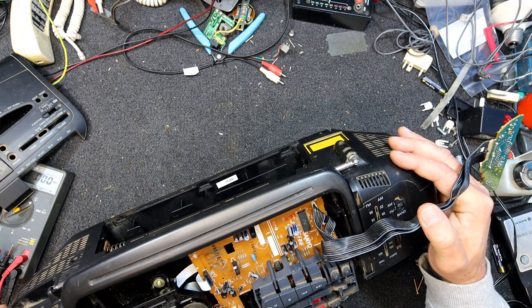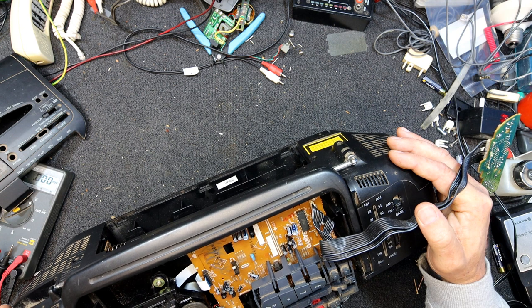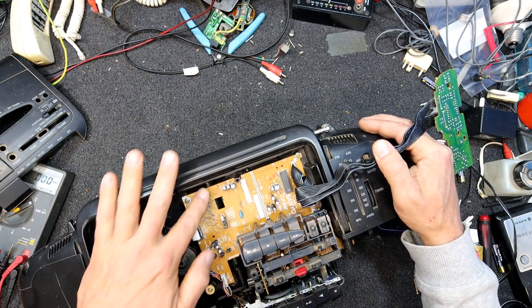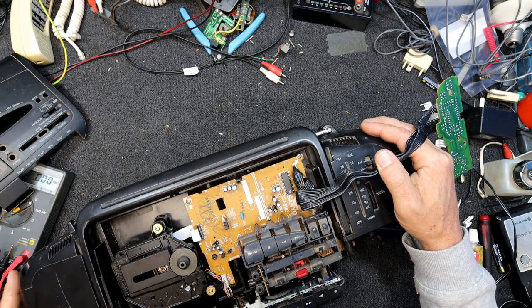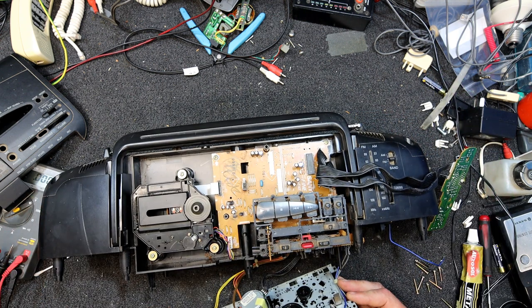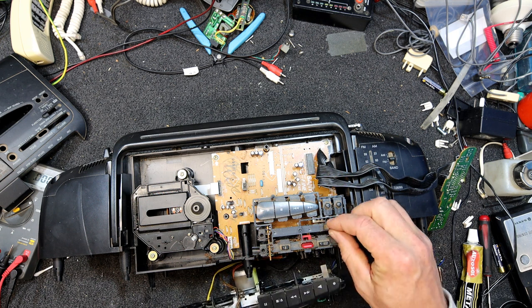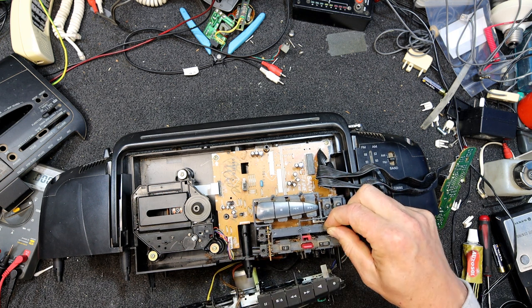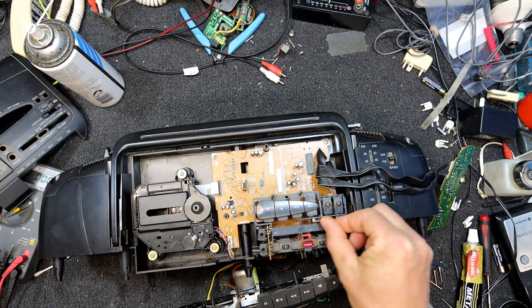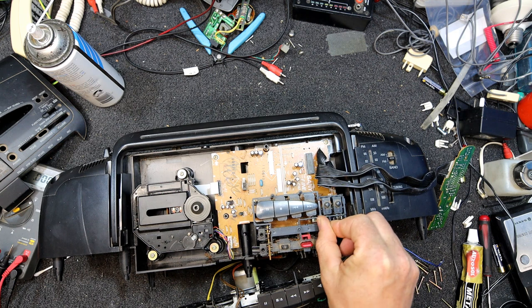Sanyo Fine CAD. Or Sanyo, and I guess Fine CAD is what they used, I don't know. There are a few stamps on things, but it doesn't say much. Someone scribbled their quality control maybe on there in blue pencil or something. So maybe the mode switch could be the first place to start, because if that's dicky on the audio, it could be dicky on the actual voltage switching to various parts of this thing. Probably not, but that can be the sort of thing that causes these type of issues. Needs cleaning anyway, so might as well start there.